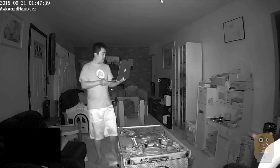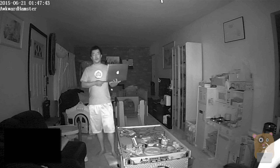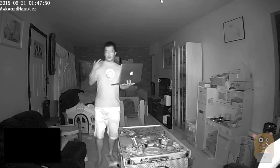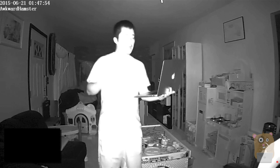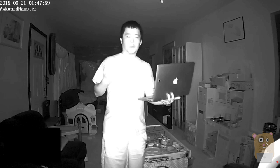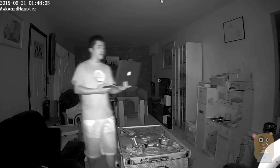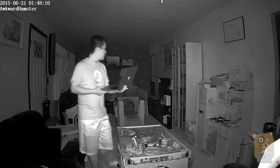It doesn't look like it's 30 frames per second, maybe 10 frames or so. But in either case, the infrared LED is reflecting off me pretty nicely, and is able to capture some of my facial features too. If I were to walk close to it, now there's too much infrared LED, and the infrared light just bounced off me too much that it's just a sheet of white. So I'll say that the throw distance for any good image, you need to allocate about 8 feet or so.